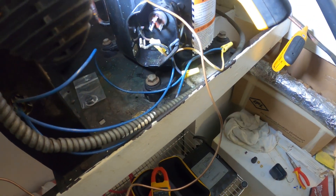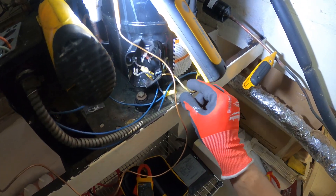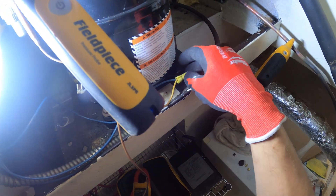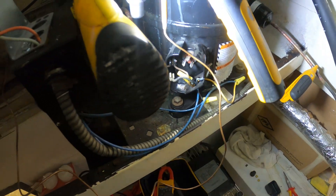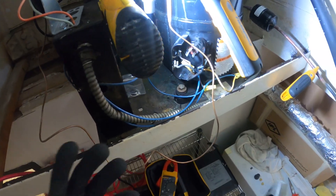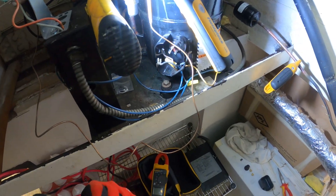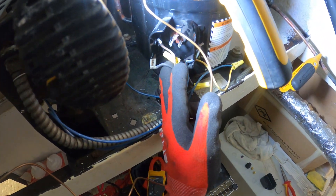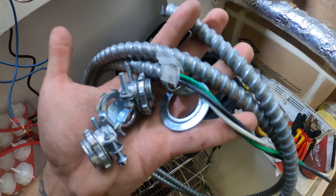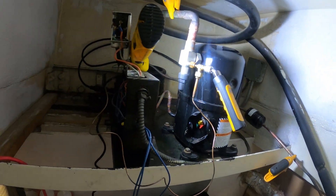All the wires are off the terminals. Terminals look decent, so I want to repair the wires. But look at this — there's just no encasement, wire knots inside there. It's terrible, and this thing is broken in here. Let's show a little love and appreciation for this unit and get it going for the summertime. I'm going to rewire all of this and put on new solderless connectors. I've got some BX cable and some connectors — let's see what we can do to revive it.